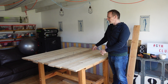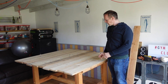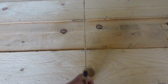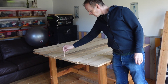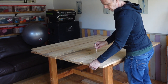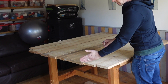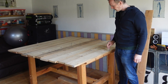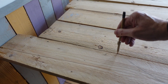Now what I've done is I've measured exactly halfway across — 73 and a half centimetres — and I've put a screw in the middle with a bit of twine on it, and then I'm just going to draw a circle with it. What I'm doing is just going round — I'm not marking yet — just to make sure I've got the boards positioned correctly so that any imperfections will be cut off. So let's draw a circle: take the pencil vertical and just go around, keeping the twine taut throughout.